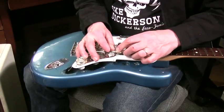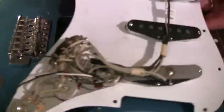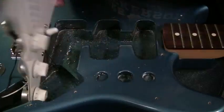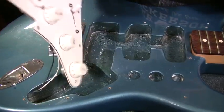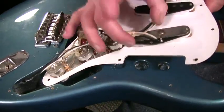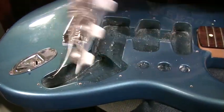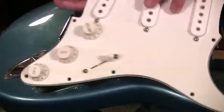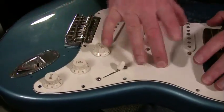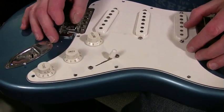A smart thing to do is wrap a little bit of tape here and here on your bundle of wires, so that when they fit in these spaces, you don't end up with a wire on top of this wood. This is also the way Fender did it, and this has to line up here because you've got a space here. All my wires are staying inside this control cavity and it's laying down like we want. If you had a wire sitting under here, you'd know it — you wouldn't want that.